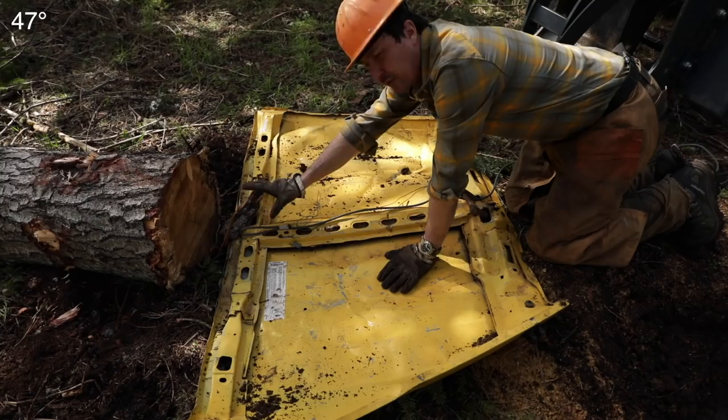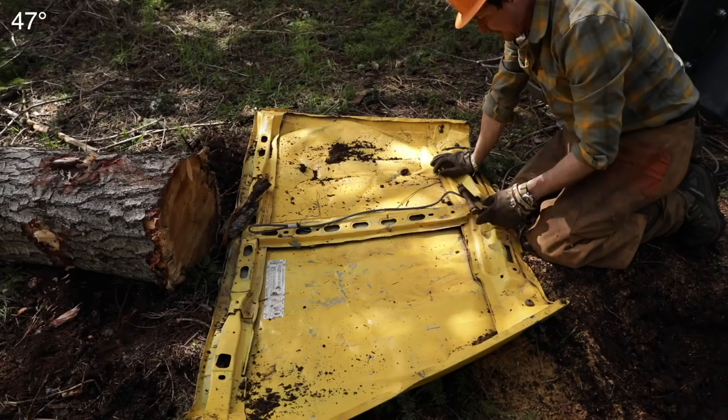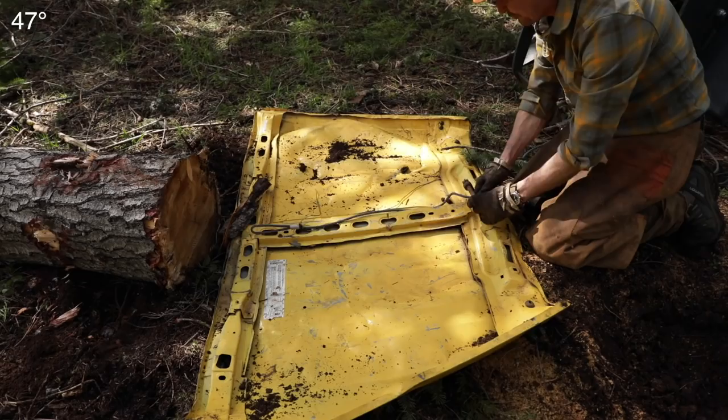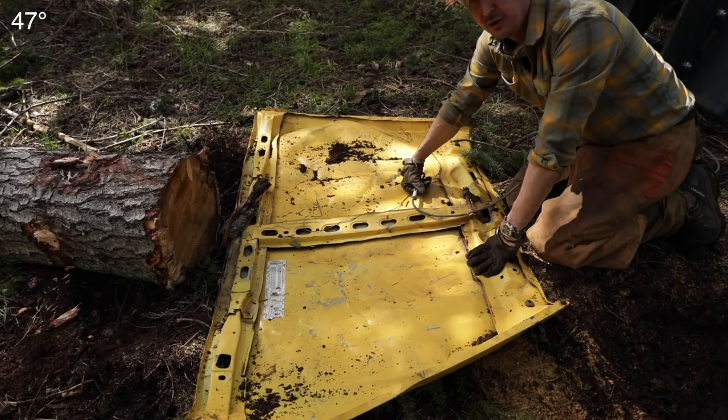And what I've done is I've put, I never can remember, shackle or clevis, this thing right here. I put this in there. You could just knock a hole in the front of your hood, get something in there that the cable or rope or chain will slip through, and as the log comes up, it'll stop here and it won't pull the log off the hood. That's the most important part. If you just try to throw a hood underneath there, you'll just pull the log off the hood and you're gonna have aggravation. So let's choke the log and it'll all come clear.